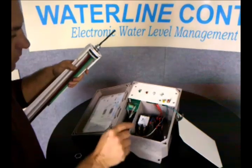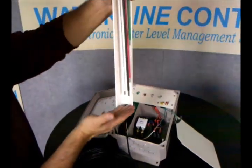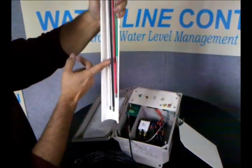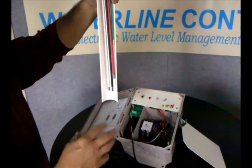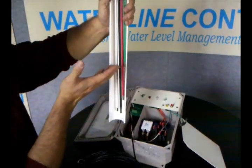It's all color-coded, so the color-coding goes into here. It'll measure the low-water cutoff point and the fill switch. The water will come down, and if it falls below this set point, it runs a little timer, times out, turns on the well pump, and fires this relay. The water then fills back up to that green pin and turns itself off.